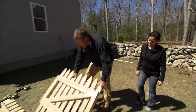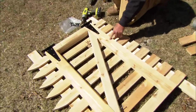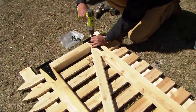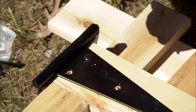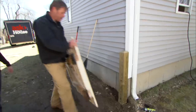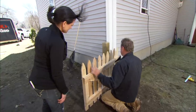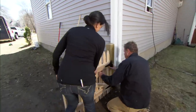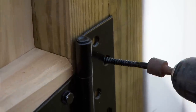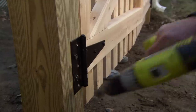Now we can lay this down. What we have to do now is put on the hinges — I can lay them out so they're in the center of this 2x4 rail, pre-drill the holes, and now I'm just going to lag them in place. The reason we pre-drill these holes in the hinges is we don't want to take a chance on splitting the rail. We're putting in a really heavy lag screw to hold this gate to the hinges. Now we're ready to hang the gate — I've got a reference mark right here, that's going to be where my top rail is. I've pre-drilled some holes so I can put in these big lag screws. We're going to lift up on this and come up to the mark. Looks good — lined up pretty good.